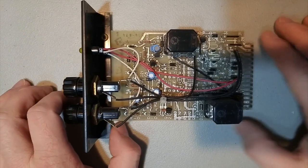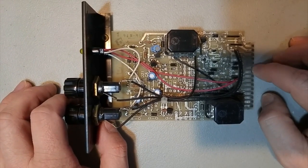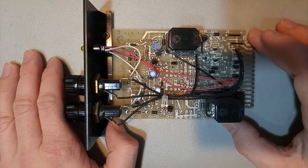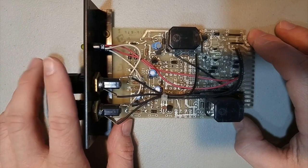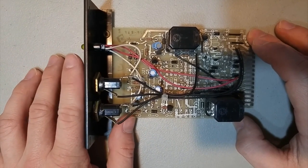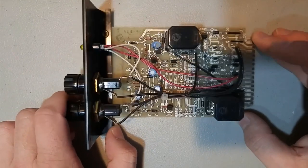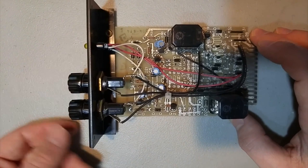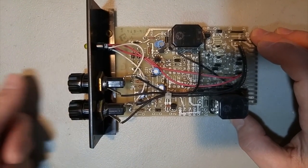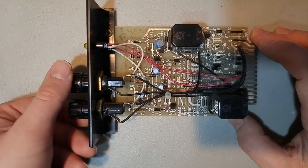And then, of course, you got your common power, and the blink circuit input. Now, what makes these a little different from the zone cards is when you acknowledge the panel, the trouble lights continue to blink. They don't stop blinking when you acknowledge, unlike the zone cards. So, it's a little bit different. Yeah, the NAC card's relatively simple. You got fuses here, and the fuses are great for testing because you can pull out the fuse and it disables the NAC if you want to do a silent test. So, they're useful for that as well.